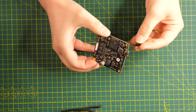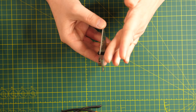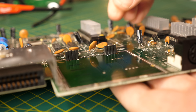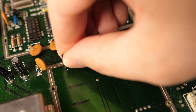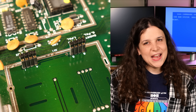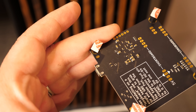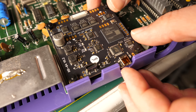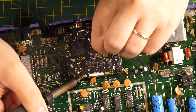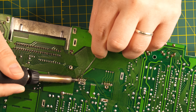With the RF modulator out of the way, it's time to build up the HD64 board with the included spacers. This gets the HDMI port to the same height as the RF jack on the back of the C64. I inserted jack headers for the HD64 into the main board and set the plug headers into the connectors. The README said not to put them in all the way, to make aligning the HDMI jack in the case easier. I added sticky tape to the bottom of the standoffs to keep the board in place while soldering, and after checking alignment it was a quick solder job.